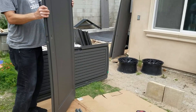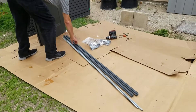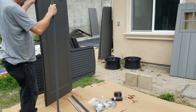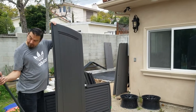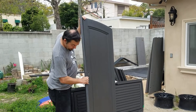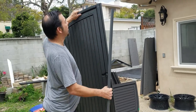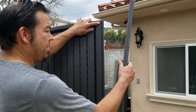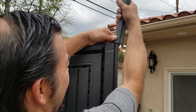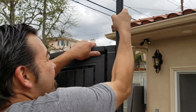The right door is the one you open first, and then the left door is going to have dead bolts on the top and the bottom where the channel is. That's the door channel I'm picking up there. Make sure the holes line up with the right door, which is going to have the indented side of that door channel facing inward — it's going to lock into the other door channel on the left. There are no dead bolts that go on the top of the right-hand door; they go on the left. You just slide it right on the top like so.